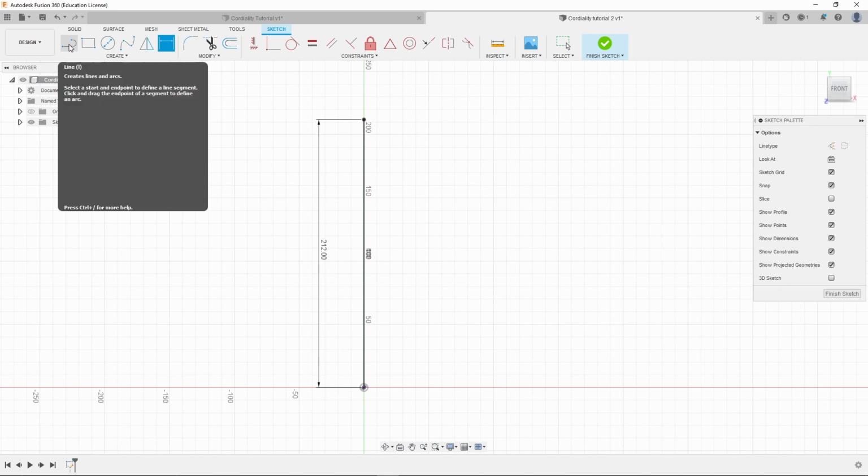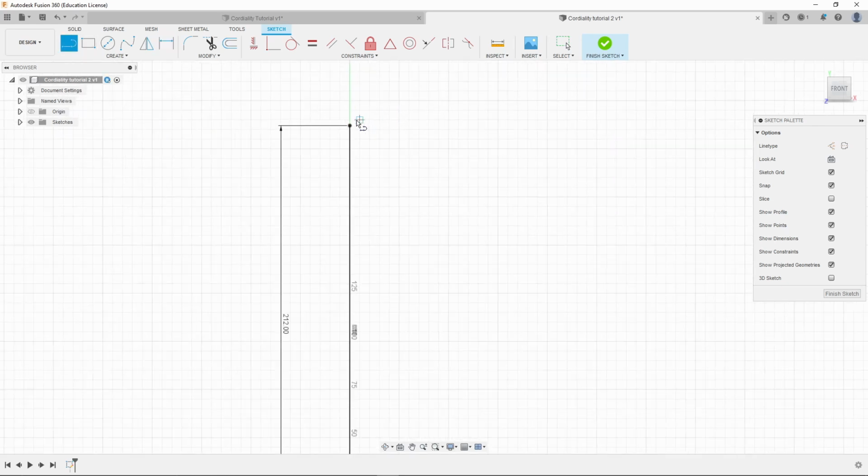And what I need to do next is create the flat surface at the top, which will be the opening eventually. We'll hollow it out afterwards, but at the moment I'm just going to create it as a solid shape. So if I come along here 15 millimeters wide, that will mean that the bottle is 30 millimeters wide at the top. That's a bit wide, I think.